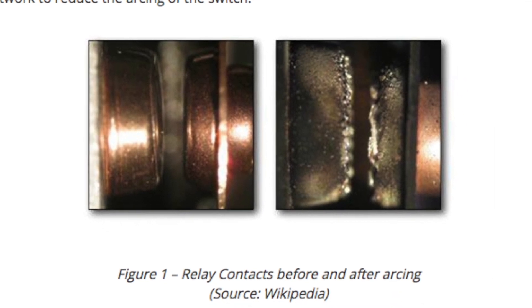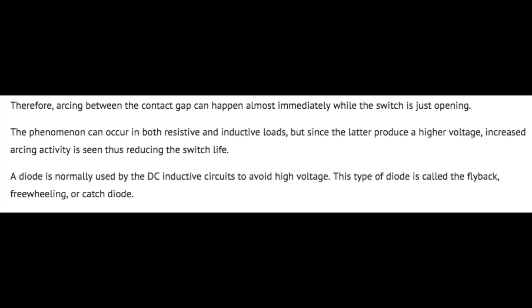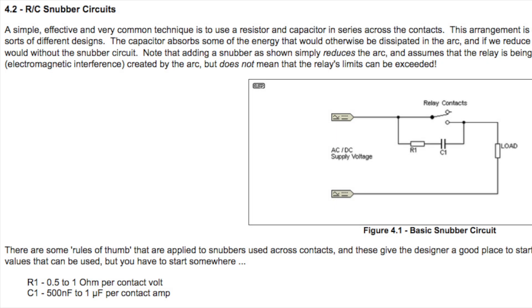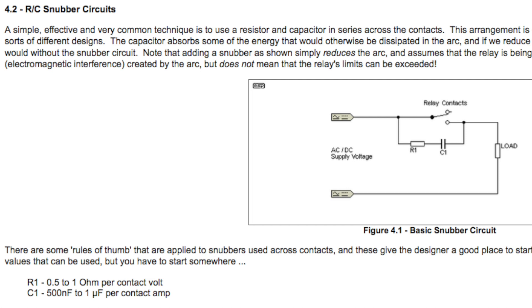That's why they were able to clean the contacts and get them to function again. It's not unusual for arcing to occur on contacts connected to motors or solenoids. Adding some kind of arc suppression is the best way to handle that. Here's an example of what's called an RC snubber circuit — a capacitor and a resistor in line with the contacts. It allows any surge of current to be absorbed by the capacitor, and the discharge is regulated through the resistor so it doesn't give a big surge back out. The rule of thumb is about 1 ohm per contact volt and about 1 microfarad per contact amp.